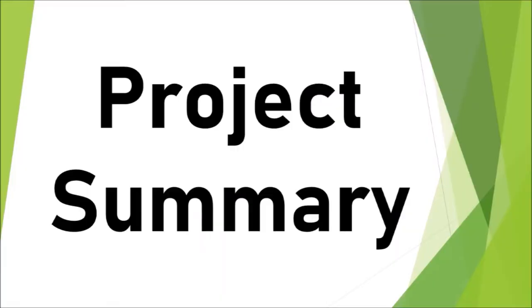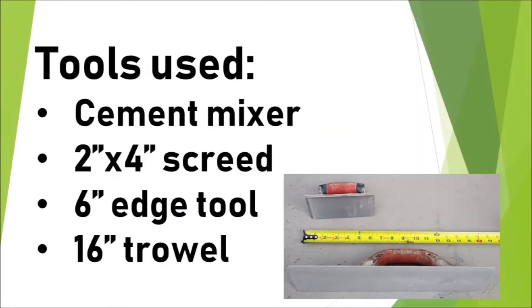And now for a quick project summary. The tools I used were a cement mixer, and there's information on the one I used in the description below, a 2-inch by 4-inch screed, a 6-inch edge tool, and a 16-inch trowel, and there's a photo of the edge tool and trowel for reference.